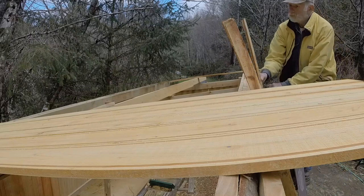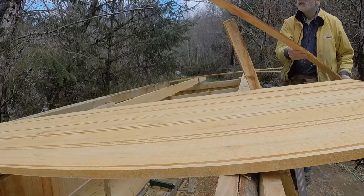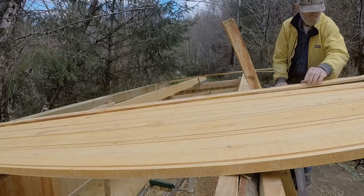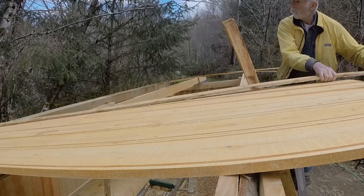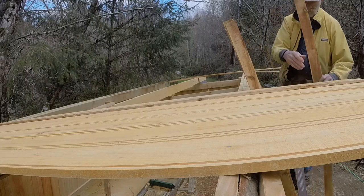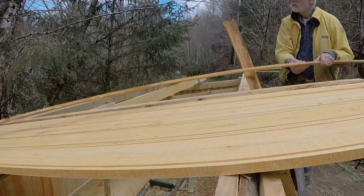The roof is going slowly. First, I have to cut trees, drag logs, mill them, and the slow part, routing grooves in the edges of each board so the rainwater that migrates toward the gap between the boards will be captured and go off the end of the roof.